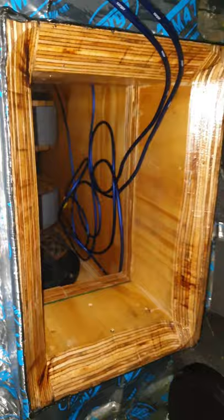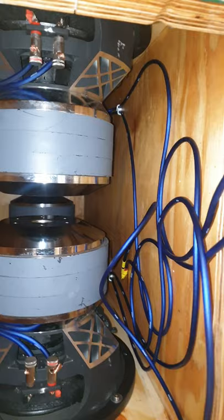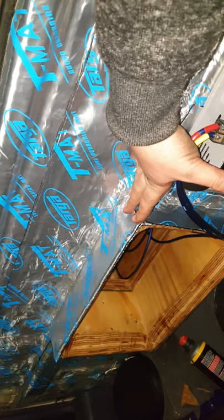So this is the new setup. I've got a much bigger port that I've installed. There's the new and improved fourth-order of mine. Basically, from two woofers I've gone to four — exactly the same woofers. I've just redesigned the box and tuned it; the port side is tuned to about 52 Hz, and the sealed compartment is around the free resonance of the woofer.